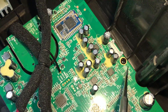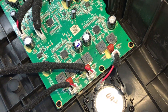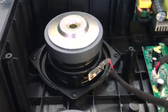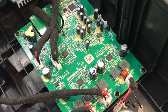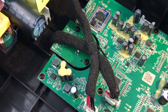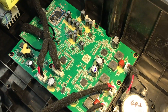The jack has some filtering, there are power supplies, a processor, two amps — and just look at how nicely everything is done. They've put only connectors, so you can hot-swap the wires, very nice. The speakers look quite decent and sound decent too. Everything IKEA makes is so thoughtfully and neatly engineered — very nice to see everything labeled, and the cutout for the volume encoder is a nice touch. They could have just soldered wires to the main board, but no, they went the extra mile.